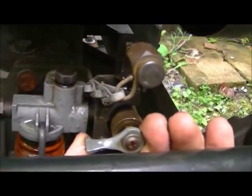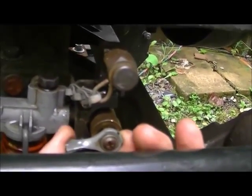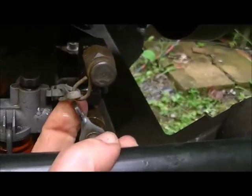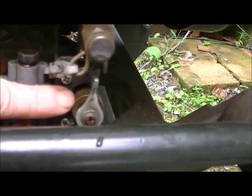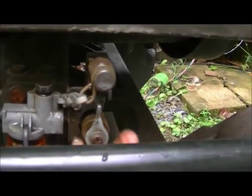Now when the valves get dry in the fuel pump, the generator will start anyway because there's a little bit of pressure pushing the gas. The trick with these valves — a lot of people don't notice — is you pull out while you turn and they turn really easy. The reason is a tapered shaft inside that tends to bind if you don't pull out first; pulling out just loosens it right up.